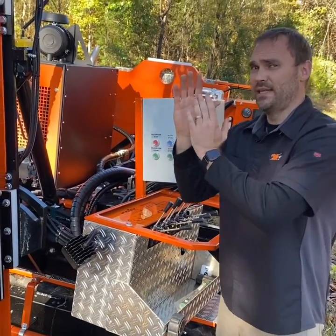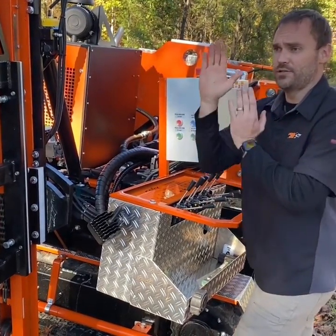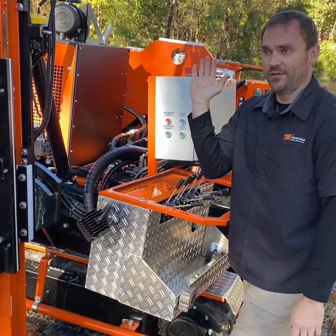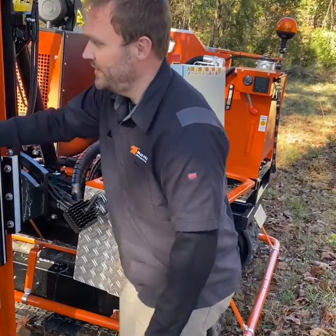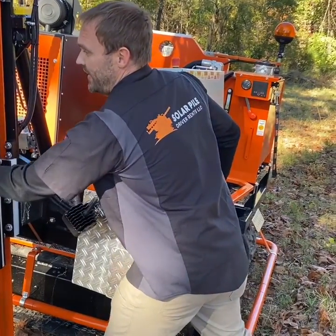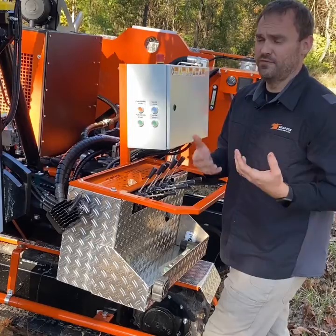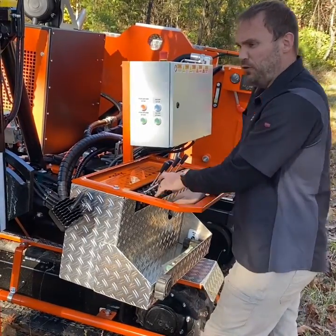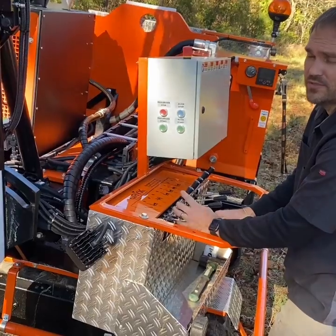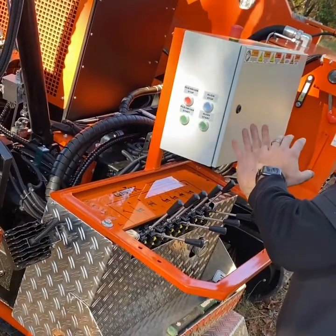What I'm talking about is what I call the mast leaning back. Whenever I start to drive a pile on super hard ground, as I'm applying down pressure, the mast is going to want to lean back. There has to be enough down pressure to have the pile lift the head up and press the cylinder up to actuate the hammering action. What I like to do is a feathering action — instead of full bore down and hitting the hammer, you give it just enough down pressure to engage the hammer for a couple blows, feathering between the two so the mast doesn't lean back all the way.